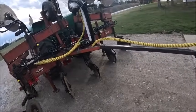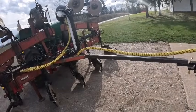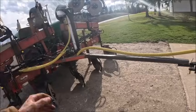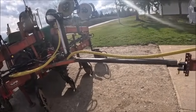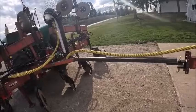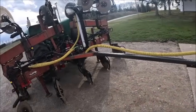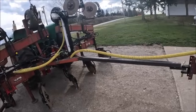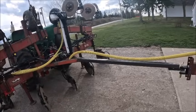Not a lot, but I did get grade 43 chain, which is I think 2650 working load, so a little over 5,000 pounds total between the two. They'll never see 5,000 pounds of pull. But I think that's all we needed while it's hooked up. I'll do the hose.